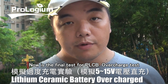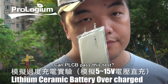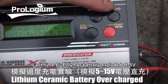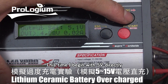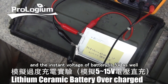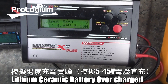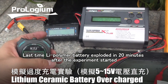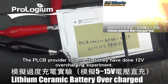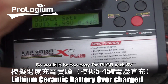Now for the final test — the PLCB overcharge test. This is a simulation to see what happens if I overcharge the battery when the protection circuit doesn't work. Last time, a lithium polymer battery exploded at 5V in about 20 minutes. This time I begin with 5V directly. The charging voltage is 5V and the battery voltage is 5V as well, with a current of 0.63A. We set a 20-minute countdown on the stopwatch. The PLCB provider told me they have done 12V overcharging experiments, and the maximum voltage of PLCB is only 4.2435V — so would 5V be too easy for PLCB?